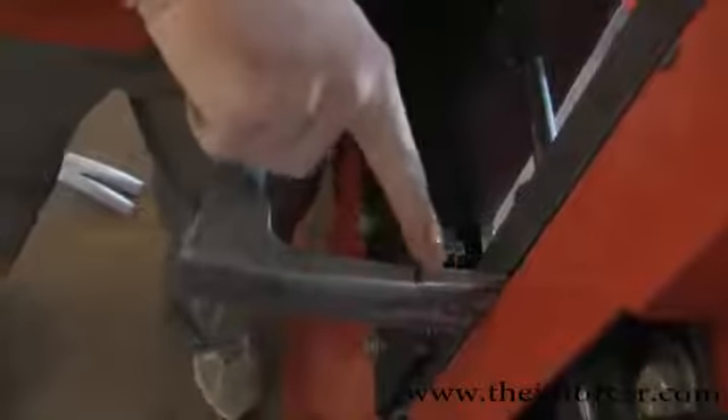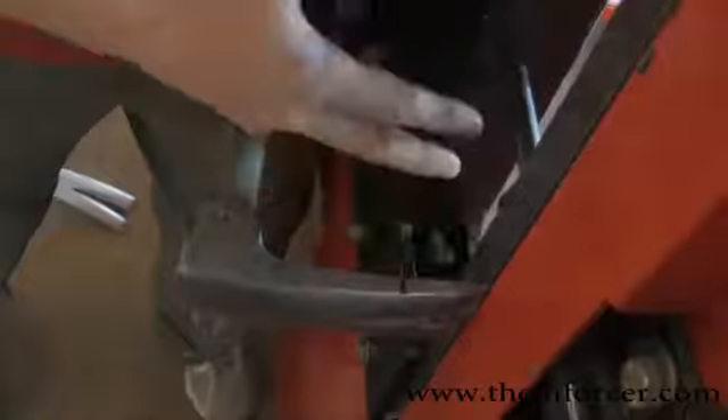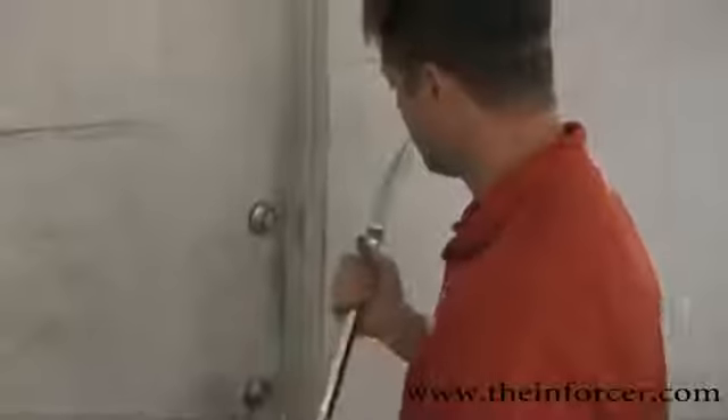If you go further, you risk going into the doorstop and tearing into that when you're trying to crush the door or guide it around that doorstop. If you fall short, you run the risk of crushing the door and not reaching that inside door skin — you might just end up tearing that seam with a crushed door and an intact inside door skin, making it a really tough situation. So this is a true steel commercial door and we're going to show on this door, just like the Enforcer door, the difference that taking these little machine edges off the Halligan makes.